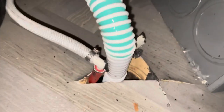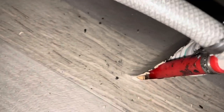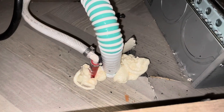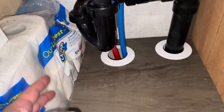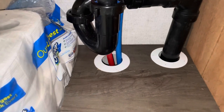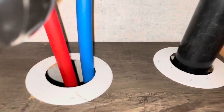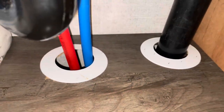So I'm under my sink and there's a spot right there on the floor where they can come through. You can see there are a couple of droppings in here, so I'm going to close all this up with expanding foam. I just hit that hole — it's all plugged up — and there's another spot under the sink I need to foam too. Last week when we found that mouse there were droppings in here, and they got into one of the toilet paper rolls because there's a huge opening. I've got an access panel underneath that I'll pull so I can put something around the bottom of the hole to keep the foam from dropping down and try to be somewhat neat about it.